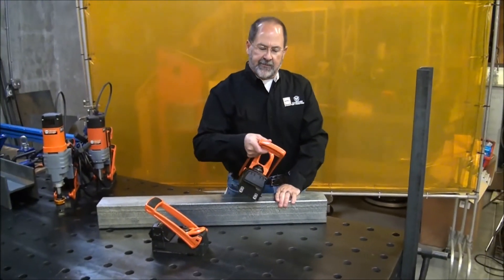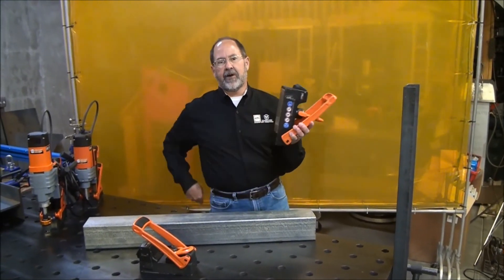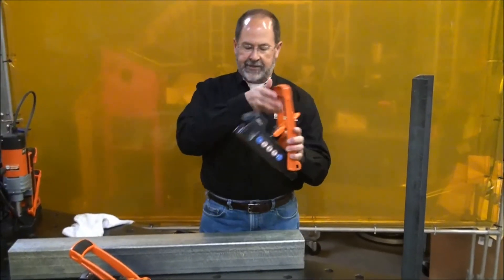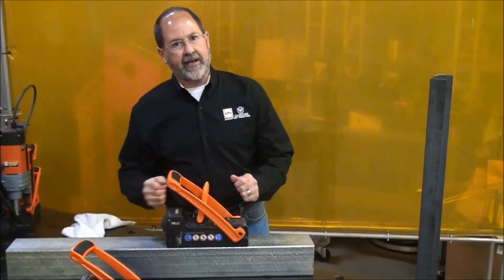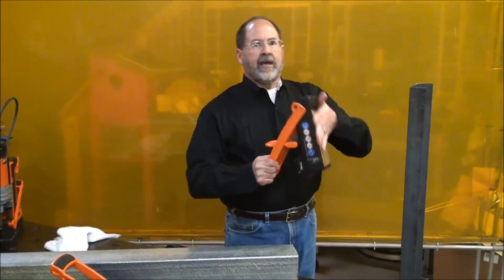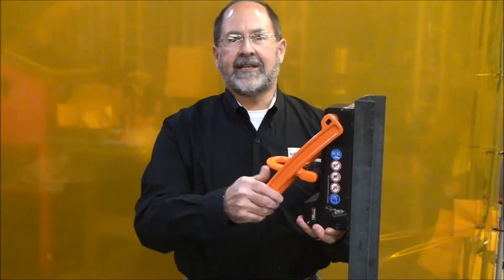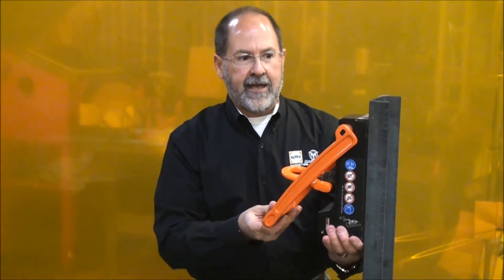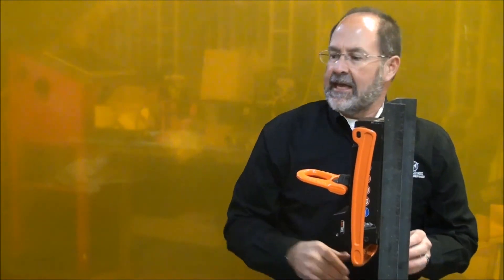The other thing you'll like about our magnets is we leave just a little bit of residual magnetism in the off position on all of them. So before you use them, give the bottom a quick wipe and always wipe off the surface you're attaching it to, then simply put it in place and turn it on. With that little bit of residual magnetism, it's easy to take something this lightweight off the hook and use it for all your fabrication needs — even vertically. It holds its own weight just about perfectly, which means you're not carrying the weight of the machine until you have a chance to turn it on. Even with limited contact on thinner metals, safety and ergonomics are covered.